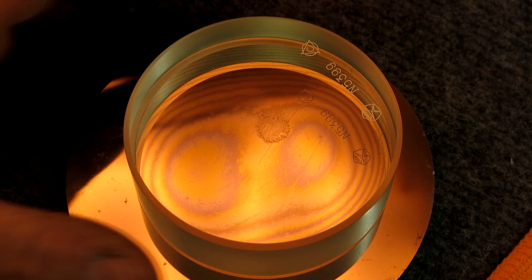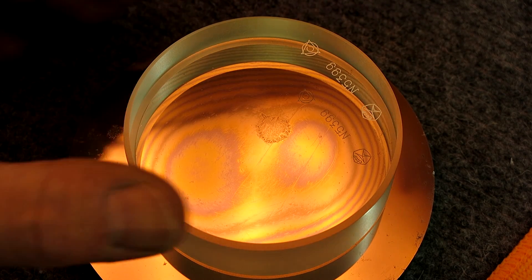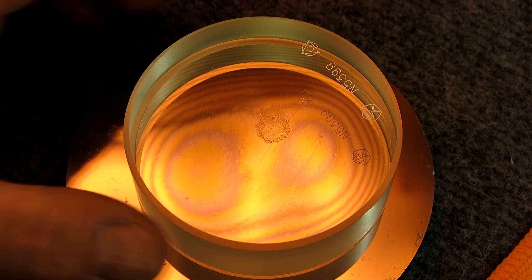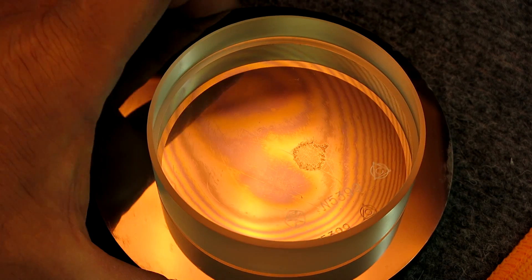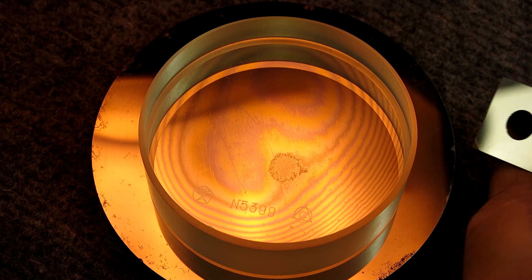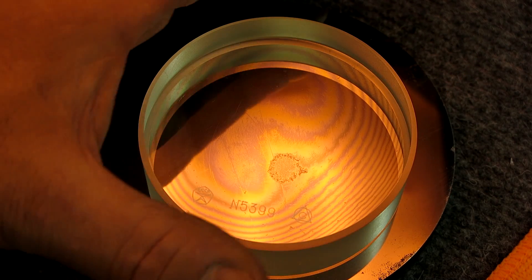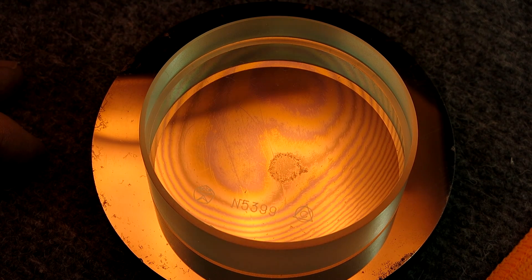So Rick, I'm going to send your optical flat back, and it seems to function as advertised. Play around with it and see if you can get it to produce some fringes. Now you need some flat surfaces — use the gauging surfaces of gauge blocks or other things that you're pretty sure are pretty darn flat. If you guys are interested in playing around with this kind of interferometry, which is pretty neat and accessible, these are like 60 or 70 bucks on eBay. I would suggest starting with daylight fluorescents initially because the helium lights can be kind of expensive. You can actually do some useful work with just fluorescent lights. Thanks for watching guys.